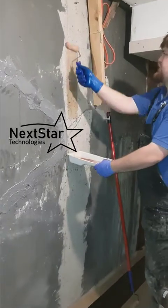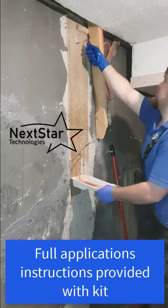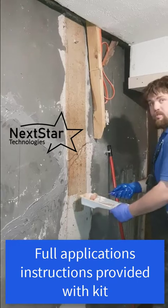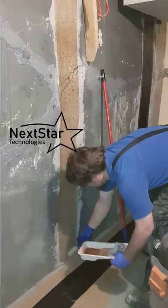Here we're wetting the wall with the carbon fiber epoxy, just rolling it on — no caulk tubes or caulking guns required. It just rolls on like paint and comes in jugs that mix easily. This is 8-inch carbon we're applying, so it's only about two roller widths.